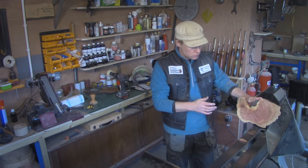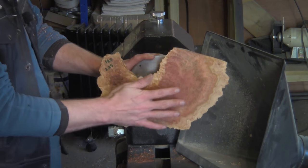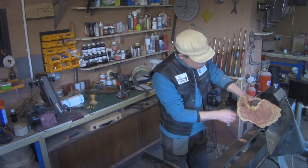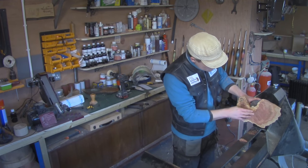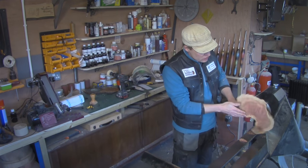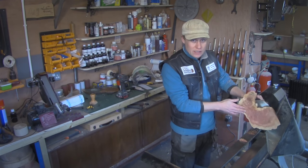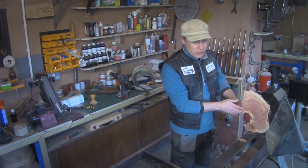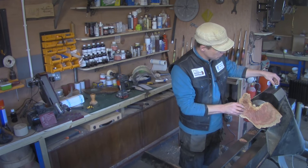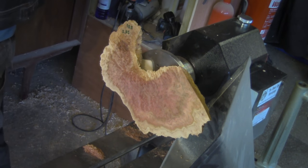Now I've finished facing off the piece as much as I want. I've left that bit because I don't want to take too much wood off the surface. So I've got the extractor running and I'm going to sand it down, but because there's so much air to catch, I don't think sanding it with it spinning is a good idea. So I'm going to put the spindle lock on and sand it stationary, and I'm going to use the drill